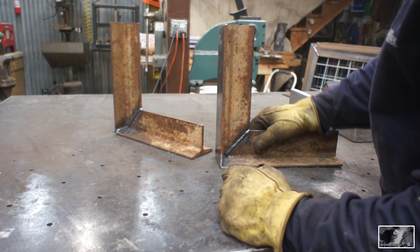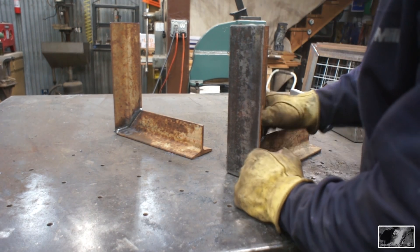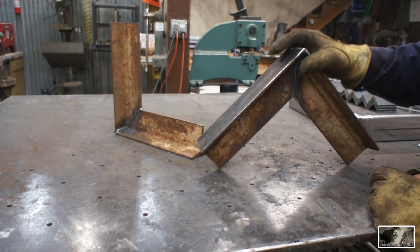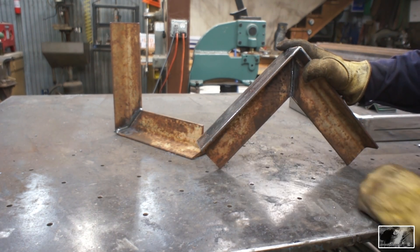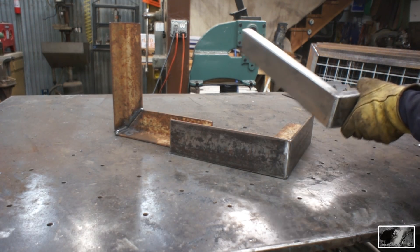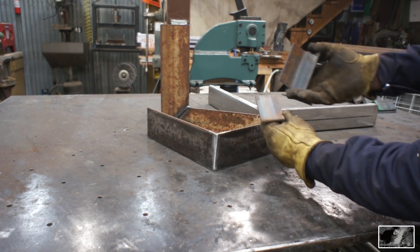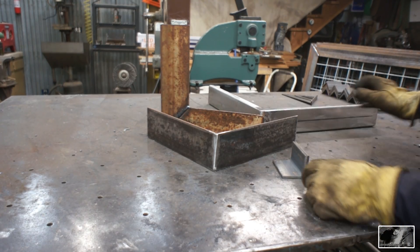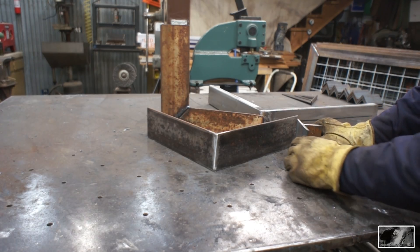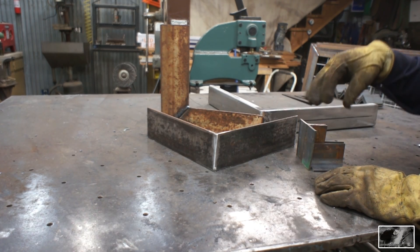I'm really happy with the way these things came out. They are solid. I haven't finish ground all this off yet — I would like to take them down to bare metal, maybe paint the back side, leave the front side bare. The only other modification I can foresee doing on these is 45-ing these back, because you can't rest them on the table like this. And on all three of them I really rounded these corners, because it's nice to be able to clamp — if you have a fillet weld in a corner, it's hard to clamp, so I rounded these off. Something like this is really easy to come up with using angle iron. You could weld a couple pieces into an I-beam, which is a very strong shape, then cut them and 45 them, and you'd basically end up with that exact same shape. You can use kind of whatever you have laying around as long as you have the rigidity.